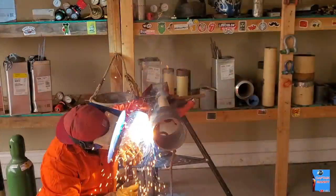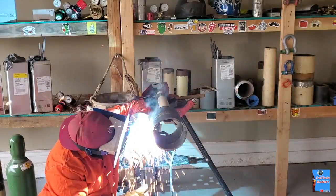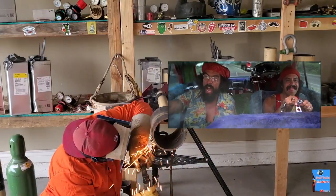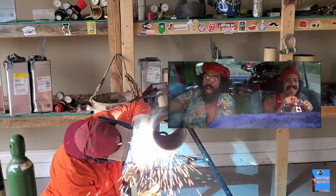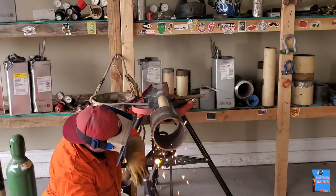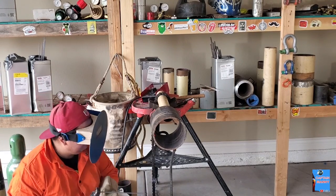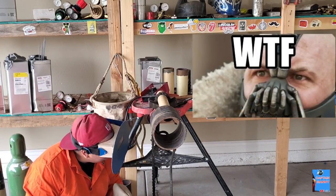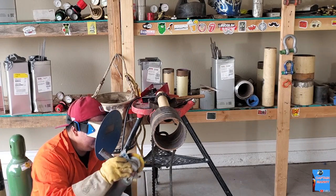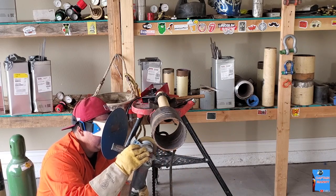But for the cap, a welder also told me, fourth gear, and you want to have the amperage bigger than the voltage or something like that. So what that means is fourth gear and a 40 instead of third gear and 50 or 65. So that's what I tried today. 5/32 8010, fourth gear and 40, guys. It actually worked pretty good for me.